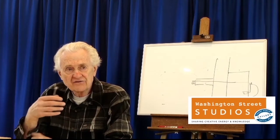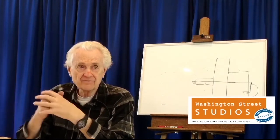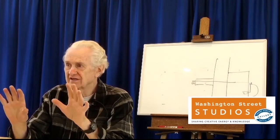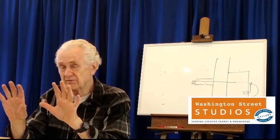Is it torn? And especially, is it brittle? Because fiber blanket, after it's used for a very short period of time, gets brittle. When you first install new blanket, it's flexible and soft, almost cottony-like. But after not too long a while, the fibers get very brittle. And just touching them, they break and fall apart. So fiber lining is great if you don't touch it and you don't bump it, and you're not moving it. Besides the obvious thing that you don't want to be breathing the broken fibers, it also is easy to damage once it gets really brittle.